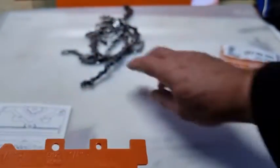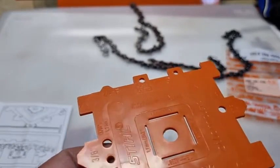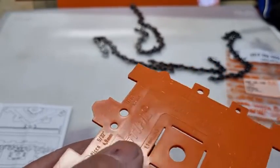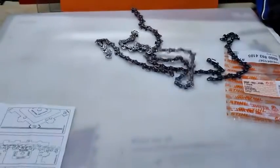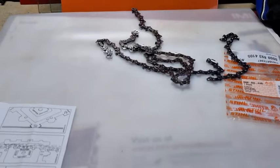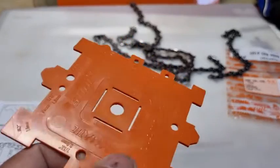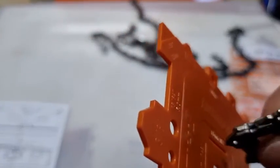It's good that the drive links are included, so if you're not 100% sure — especially on 0.050 and 0.058 gauge — you may wonder which one is which. But it actually is quite a nice tight fit. That's 0.043 gauge. Then if you go to 3/8, we'll just grab a drive link from 3/8 — that should be 1.6, there it is — 0.063 gauge. Fits in there, good.